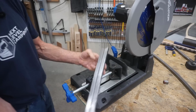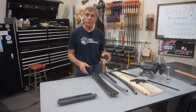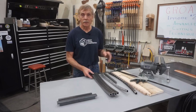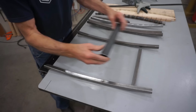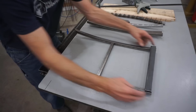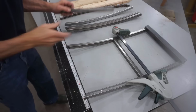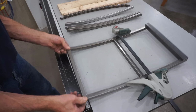After fabricating the kerf bent roller ramp tube and cutting the miters on the two pairs that I'll use for my roller stands, I feel that I've had just about as many elephant steaks as I can handle for right now. So for dessert, I want to show you what this roller ramp support frame looks like now that all the pieces are complete. Starting with the notched tube from early in this episode, I can lay it on the left and right mitered roller ramp support tubes, place this spacer that was cut in episode 1 in between, and use a squeeze clamp to hold the whole works together, approximately like that, so that you can see how this mitered piece will fit in the end here and get all welded up for a nice, clean, solid, and rigid frame that supports the acrylic piece that makes up the ramp itself.